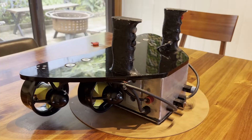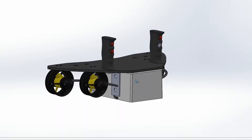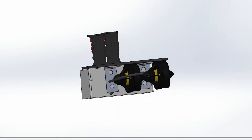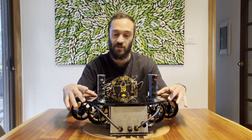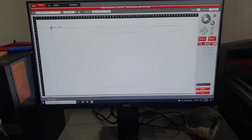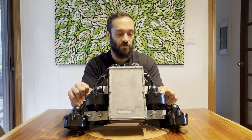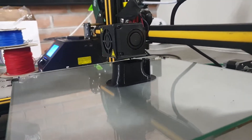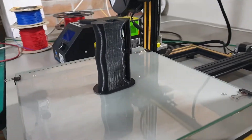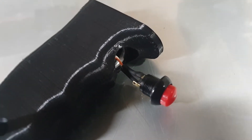A little while back I salvaged these underwater thrusters from a project that wasn't being used anymore. I did a basic design in CAD and came up with a delta wing shape. I laser cut this piece from 10 millimeter thick acrylic and that acts as the sort of top surface or wing of the design. To that I screwed on four thrusters and I 3D printed two handles, reinforced by two steel rods inside, and mounted some waterproof buttons to them to control the thrust of the device.